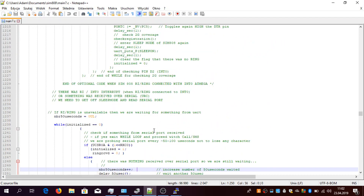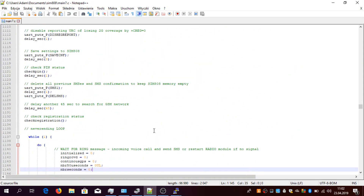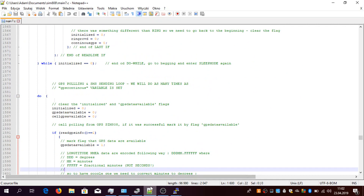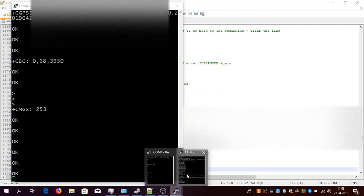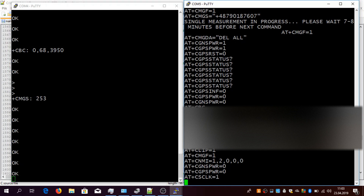The hardest part for the code was how to calculate the GPS position properly. It's a bit funny but the problem was that the SIM808 board has a different GPS format than what Google servers are using. So I need to make some computation — some calculation — to encode the Google position properly. This is done by this part of code which looks somehow different and strange, but it really does the job. I already got the message — yeah, the message was sent with my location. It took almost less than two minutes to get the location with such a large GPS antenna.